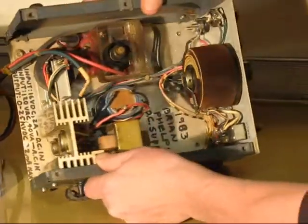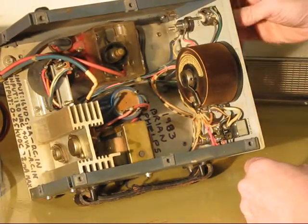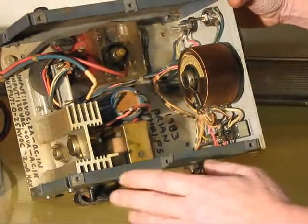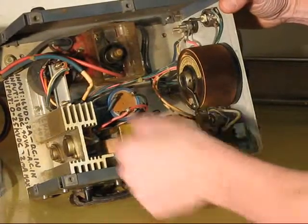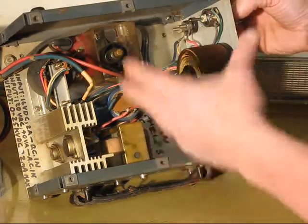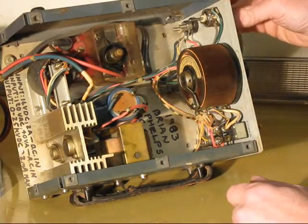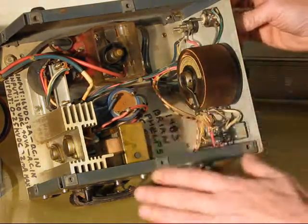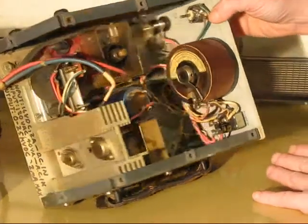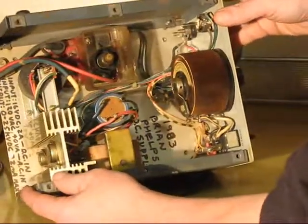Not a lot to see in here, you know, power switches. There is a control here that allows you to tweak the operating frequency. It centers about 15,000 cycles, 15 kilohertz, because that's what this flyback was designed for. It's variable because certain loads cause it to chirp or hunt or dit-dit-dit-dit. And so you can get it off of that by changing some of the feedback, the way the oscillator works. There are no integrated circuits in here. It's got two transistors. It's very primitive.